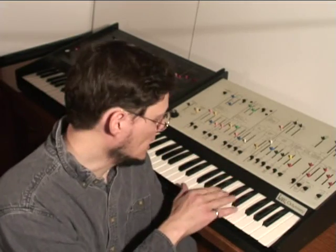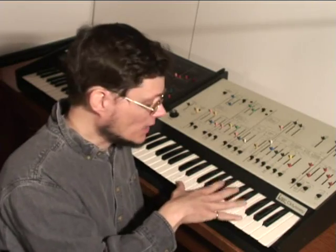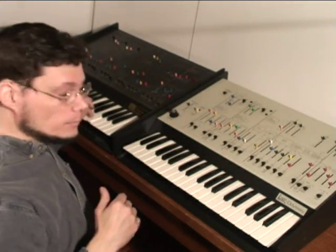There are some problems with these synths that are apparent immediately. On the white one, when you push the keyboard, everything's sticky and sometimes the keys even stay down — you have to lift them up. So I can tell there are problems with the keyboard bushings; the rubber grommets have probably all turned to goo. The black one has a slightly different problem: the rubber bushings have cracked and you can hear metal-on-metal contact. Also, a lot of the faders are really stiff, full of goo and dirt, and some of the switches don't move very well either.